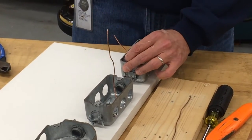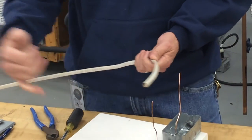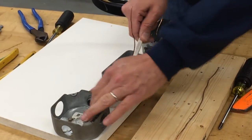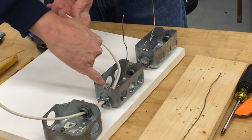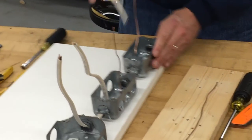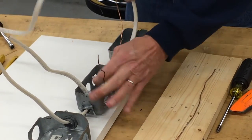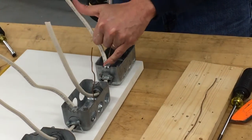Now I'm ready to run the wire. You will not get the power cord until I check off everything with the wire. We're going to be using 14-2 wire. Just like we did that for bonding, you're going to need that much wire sticking out of the back of each box — about six inches. I'm going to run one from here up into the fixture box, measure it out before I cut it, and then run another circuit from this box to the next box down in the middle. By code, you need that six inches sticking out.